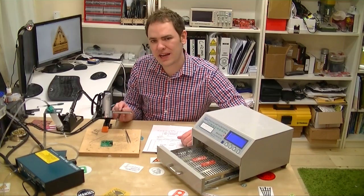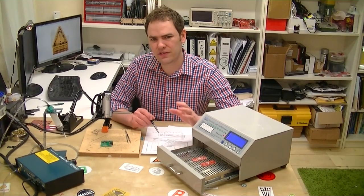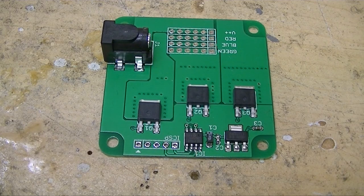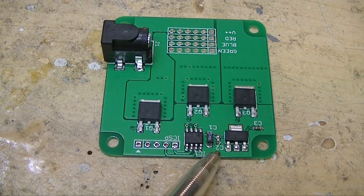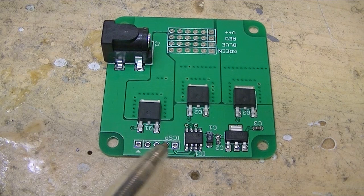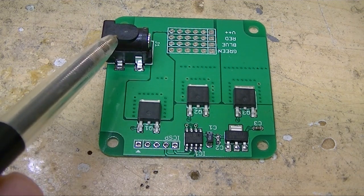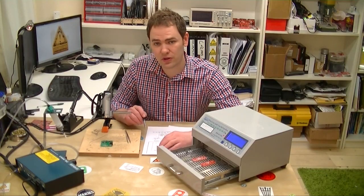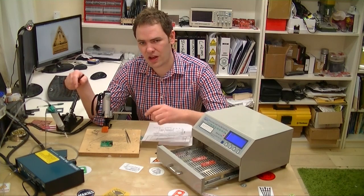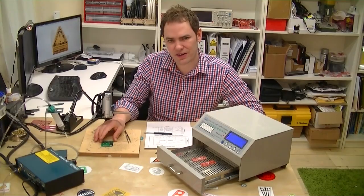To test out the oven, we're going to solder an RGB LED controller made by Shock. This is a good first board to test because there's a variety of parts in different shapes, sizes, and thermal mass. We have little tiny 0603 parts, a voltage regulator, a bunch of FETs, an 8-pin SOIC chip, and a big power connector that could actually be very difficult to reflow. I've already used the solder paste dispenser to put paste onto the pads and hand-placed the components. Now I'll put it in the oven and fire it up.